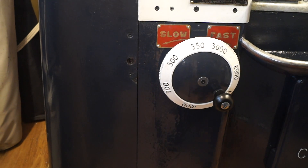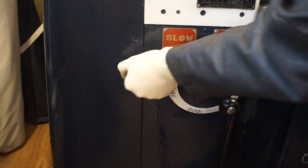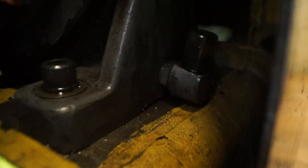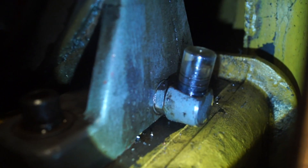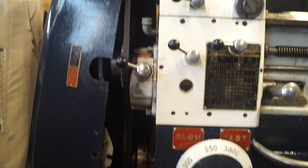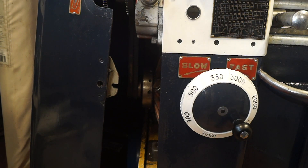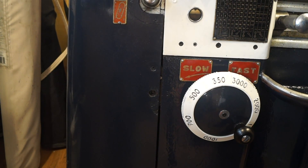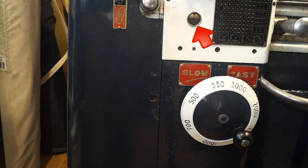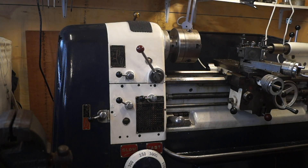Opening up the back cover, we can now see the variator, and you can see the level sight glass, which needs to be at the correct height. It uses the same oil as the headstock. I purchased all of these oils from eBay. All of the correct grade oils are in the manual, and you have to use the right oil — because if you don't, you're going to damage your lathe, and it's a complete waste of time and money. Here you can see where we fill up the oil for the gearbox. On the sight glasses, we can see the correct level of oil. With the gearbox, the oil level will change as you change gears, because the slide bar moves in and out and it pushes the oil in and out with it.